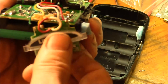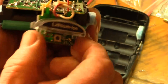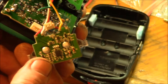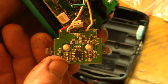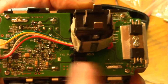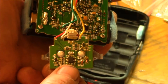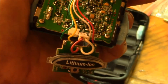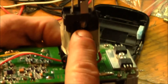I got the fuel gauge taken out — it looks like the green wire broke off, I'll have to re-solder that. I never really looked at this one before, but there's a little IC on the backside. That must be the fuel gauge functionality — it was added on to the basic battery management system board on a separate board. That's why there's only the main power and ground connection through the connector, and all the wiring for the LEDs is separate.